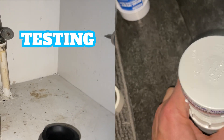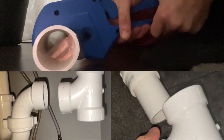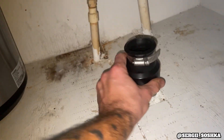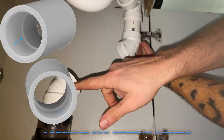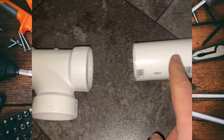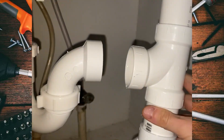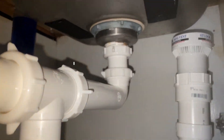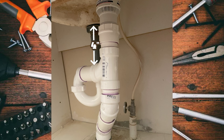For demonstration and reassurance, I'm cutting all PVC and building the lines dry to check how it's going to look with all the adjustments and angles I plan to have. Use a PVC cutter tool or a multipurpose saw, and account for fitting depth while doing cuts — you can always remove more length, but you cannot add it back. As tight as you are with maneuvering the piping, remember your air admittance valve should be installed as high as possible, preferably above the level of the sink drain to prevent overflow back-up, but definitely at least 4 inches above the waste arm of the P-trap.